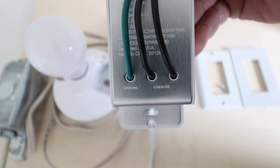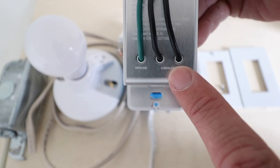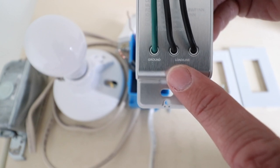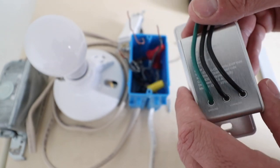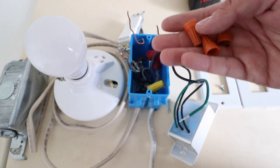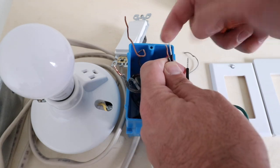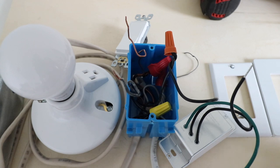You can see on the back of the switch the designation for each wire. You've got the load and line wire here — and like we said before, these are non-directional, so as long as you have one connected to the load wire and one to the line or hot wire, you're good to go. The green ground wire is over here. In the package there are wire nuts, so we're going to use those to make the wiring connections. We take the existing load wire and connect it to one of the black wires on the C by GE light switch, then screw the wire nut tight until the wires are tightly connected.